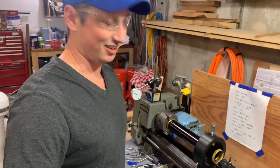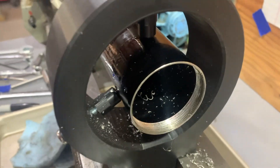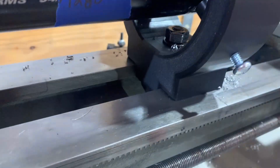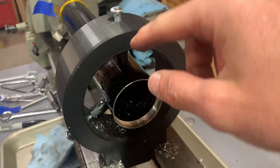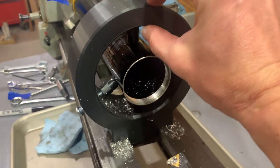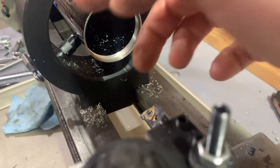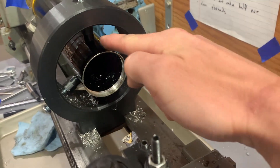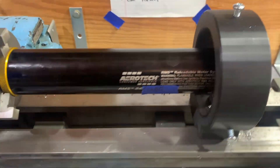Cool, so we just salvaged a blown-up case with a little helper. I don't know if I got a good video of the steady rest, but it just uses the hardware from my tail stock — the big plate on the bottom, the screws. I just printed it real thick, like two inch by half inch. Five wall layers, 25% infill gyroid. I made little PLA caps and used quarter-20 hardware, and basically the part rides on a little film of oil. It worked great — we cut internal threads.